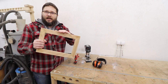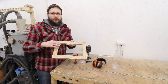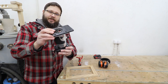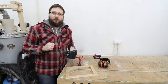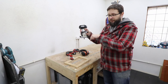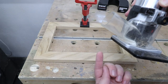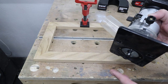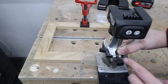A picture frame like this one has got an outer edge and an inner edge, and depending on which edge you want to use your router on, you're going to go in different ways. Now, a router is considered a fairly dangerous tool — it has a spinning bit at the bottom that if your hands get in the way can cause some harm. Holding the router with the bit pointing downwards, the router bit will go clockwise, digging into the material, and with that motion it wants to pull your router from right to left.